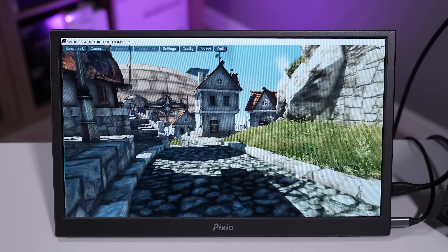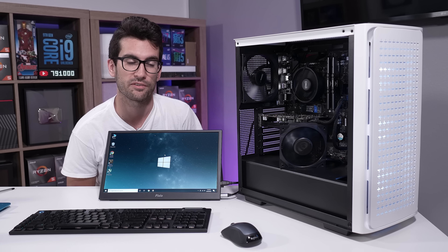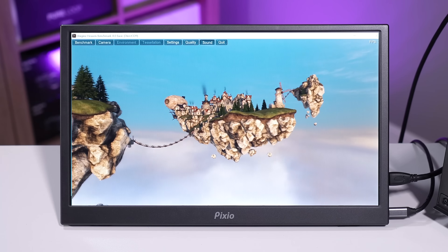We're still running Heaven after a couple of minutes at the same frame rate as before, so if there is throttling, it's pretty minor — not that these cards get very hot anyway. Then, while I'm filming, the fan just kicks in for the first time I've ever seen. It got super loud. I think it's getting too hot, so I'm going to go ahead and stop this. At least we know that what we did fixed the artifacting — that is pretty fantastic news. The big question is how long this will last. I got a lot further than I expected, so I owe it to you guys in the comments for even suggesting it. Again, I've been hesitant to show this on camera — I don't recommend you just blast your graphics card with heat. But if you're desperate and you need picture back and you think that's to blame, there you go.